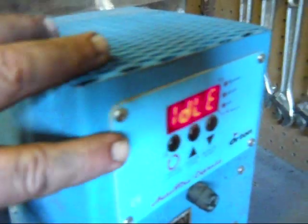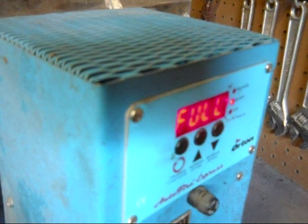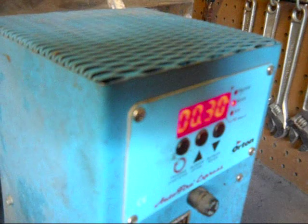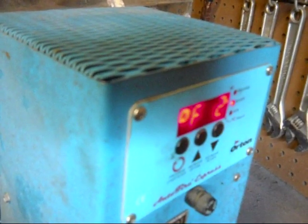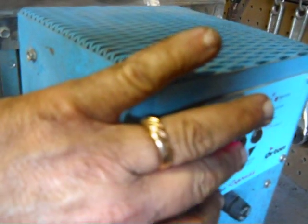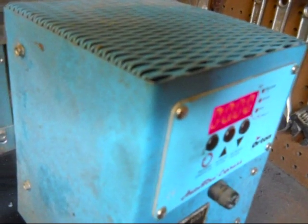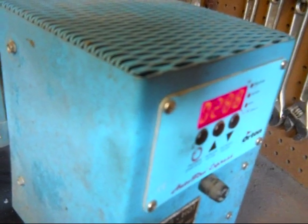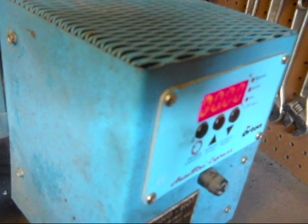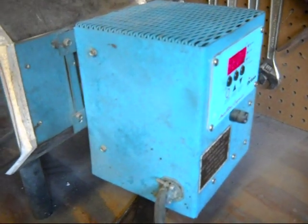The way I've got the oven set up now is it heats up to 550 degrees as fast as it can and holds it for 30 minutes. That allows me to coat the blades. Then it's going to heat up to 1525 degrees and hold it there for 30 minutes. On the first hold, I let it soak for about 10 minutes because the oven heats up very fast to 550 degrees, and I want the steel to be at that temperature, not just the sensor inside the oven. The rest of the time allows me to pull the blades out, coat them with the non-scaling compound, and get them back in the oven. Then the oven heats all the way up to 1525 and completes the process.